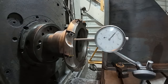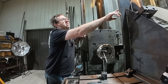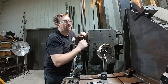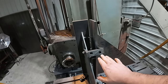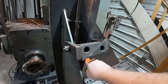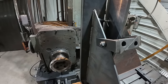I think we've made a full round. I could indicate off this leading edge too, but I'm not too worried about that. I'm more worried about the depth because that was giving me a little bit of a line where it was cutting deeper. So we're not going to worry about that much. But let's go ahead, get set up, take a cut on this first angle plate, and see how we did. And before we get started on this, I want to show you one more thing I did to improve my stability, because I added a clamp here. So I've got my machinist jacks in two places, and then I've got this clamp. She is good and tight. So we'll go ahead and start machining this thing.